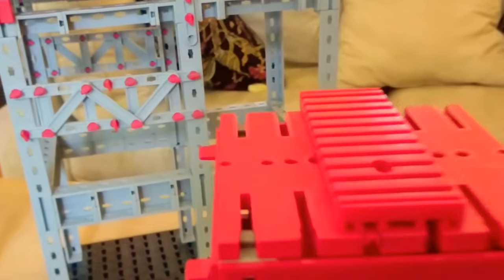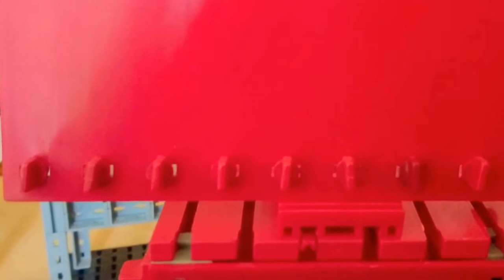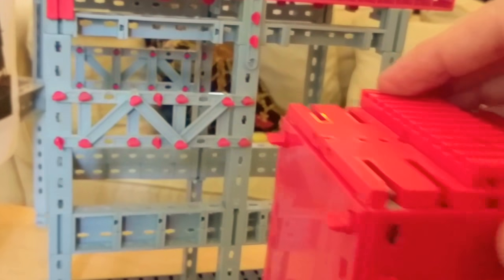What you're looking at there — here's the column. That bit there is a pad. That was a metal pad welded to the top of the column because of the huge temperature changes. The beam rested across the top of it. As the building flexed, that could rock on the column — the column itself would flex backwards and forward slightly. So that pad was a rocking pad to accommodate movement. The beam wasn't actually connected to the column, it was only connected to the middle.